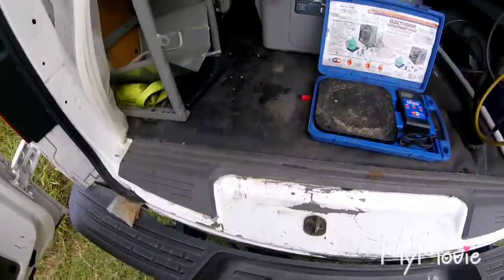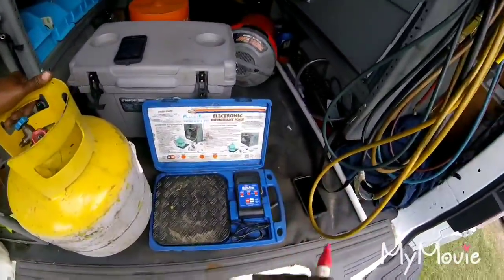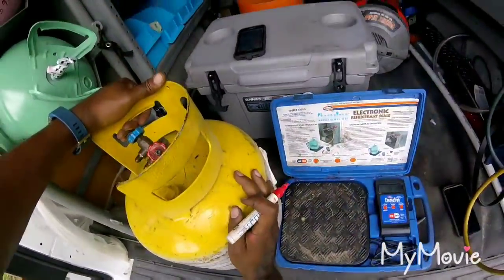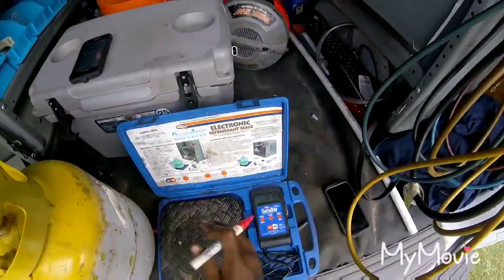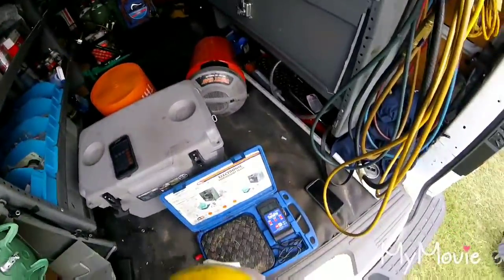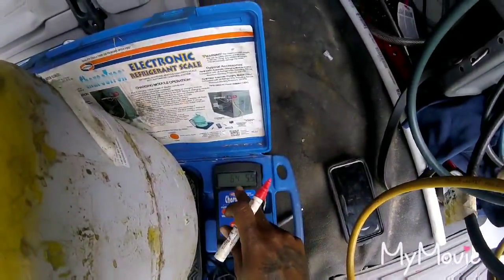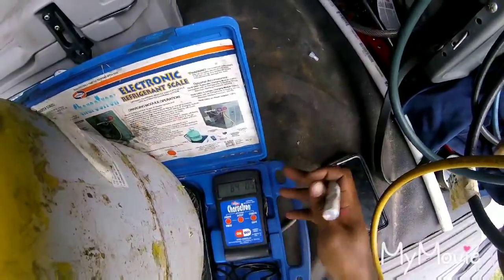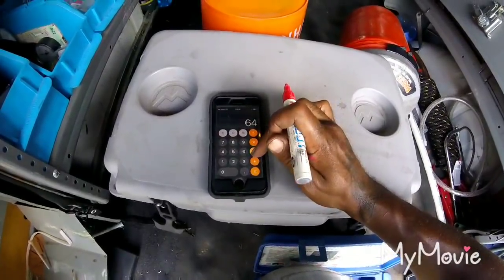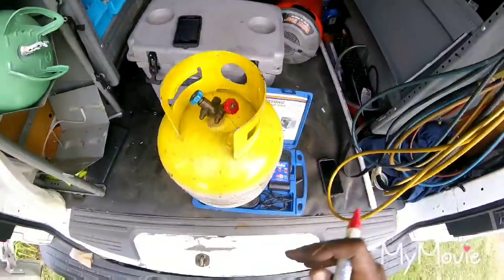This one I've already been using — I've got R22 in here. Rule of thumb, I just say this thing weighs 28 pounds. I've got my scale zeroed out — this is going to let me know how much refrigerant I've got in here. It reads 64. So I do 64 minus 28 — that's 36 pounds in here.